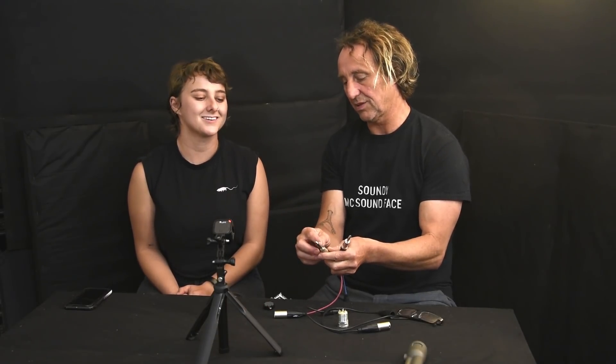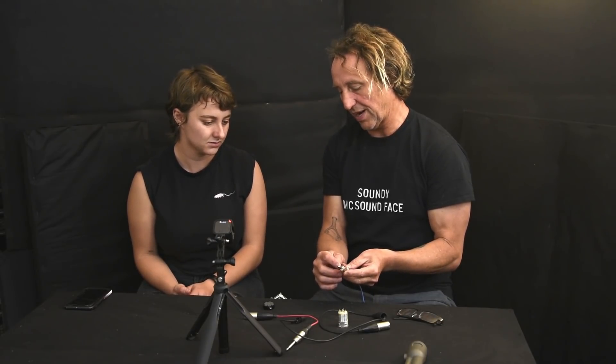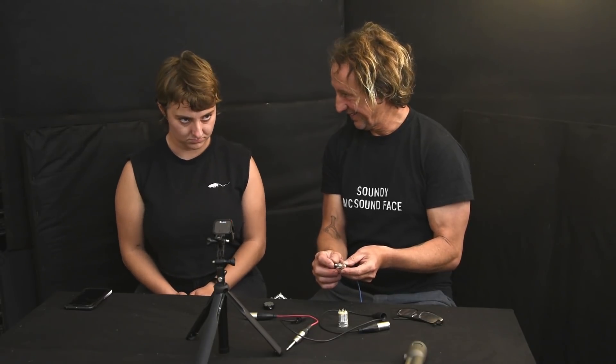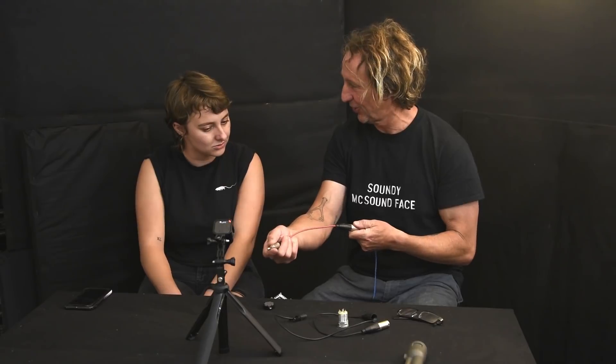You can go to a quarter-inch TRS — tip ring sleeve — or a TS, tip sleeve, or two-conductor cable. It gets a little more tricky because this same connector is used for headphones. Where headphones are ground, right, left — and if this is used for a mic cable, this is ground, out of polarity, in polarity. If you plug headphones into a balanced line out, you get in-polarity in one ear and out-of-polarity in the other. The same connector is used for multiple things. You can do the same thing with XLR — use it for a headphone cable. It's really handy if you need a long headphone cable to convert the quarter-inch to an XLR, run a really long mic cable, and then convert it back to quarter-inch on the other side.